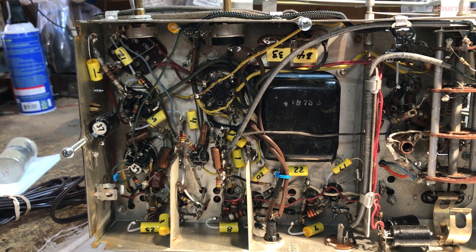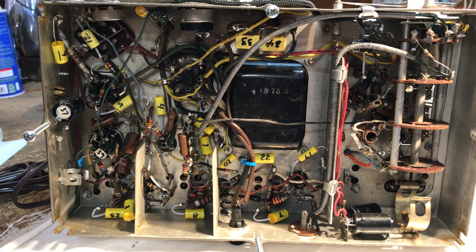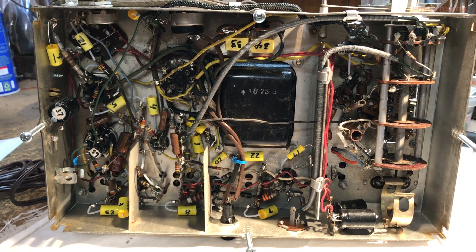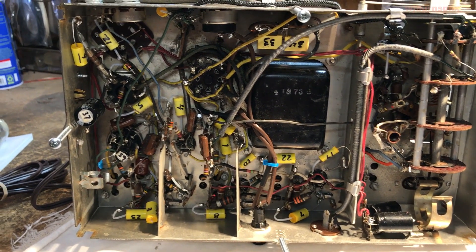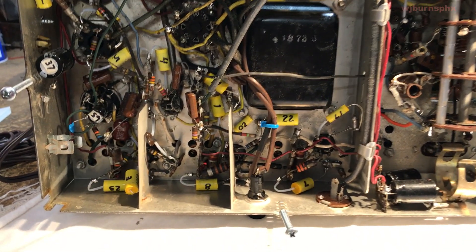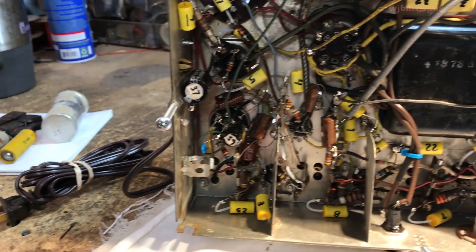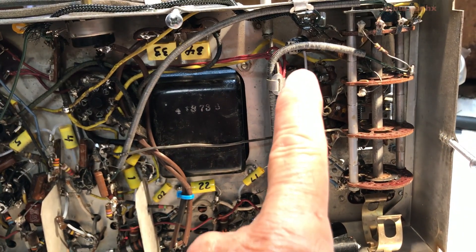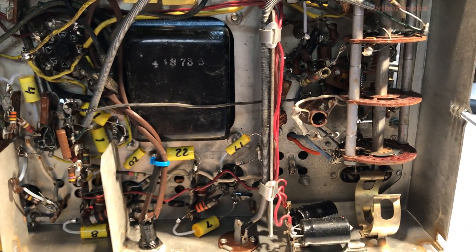One tube is a bit on the sour side, not feeling too good. I don't have anything to sub it with, and I've got it on order — it won't be here until perhaps the weekend, if then, if not Monday. We managed to get everything done in this thing — pretty much got the fusing in right here in the back panel, new power cord, polarized on it, new caps, and cleaned up the wafers on the band switch.